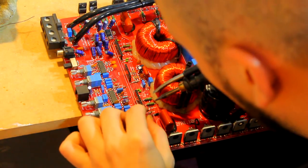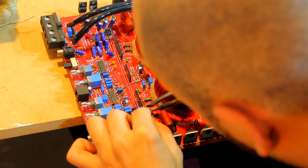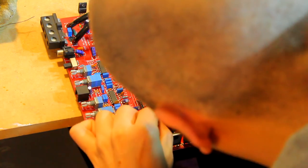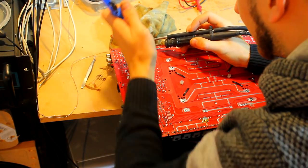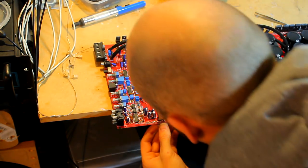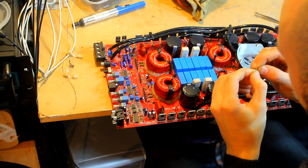And that's what you can do if you want to. If you're not sure if a component is working or whether it's just something else in the circuit that is causing it to read differently, you can just lift one of the legs and measure it outside of circuit that way. So I've just got to heat the pad up and push it back down into circuit. So let's remove this one then, that's dead, that has gone open. There we go, there's our little blown inductor.